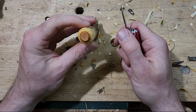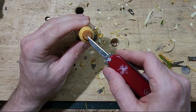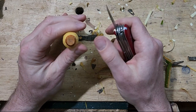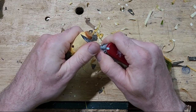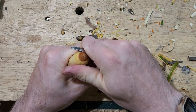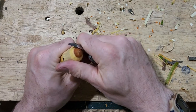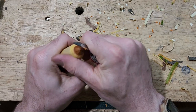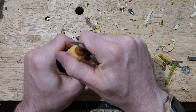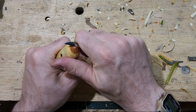Now we're looking to see how round things are. We're not bad. The pith is going to be a little bit off center, but that might actually be okay because the center is probably about right here. That means that there's good solid wood there, because sometimes even the pith in this kind of wood can be a little bit soft. So it's okay if it's a little bit off — you can work with that. When you get to the point of making the tip here, you don't want to make it super pointy and sharp, because the minute you plop it down to spin it, it's just going to bend that tip over. So you want your tip to be pretty blunt, but you do want to make sure it's got a little bit of a peak so that it does spin on that.